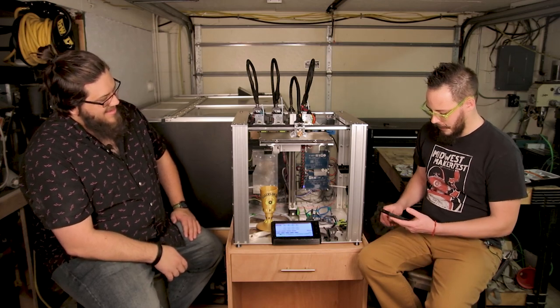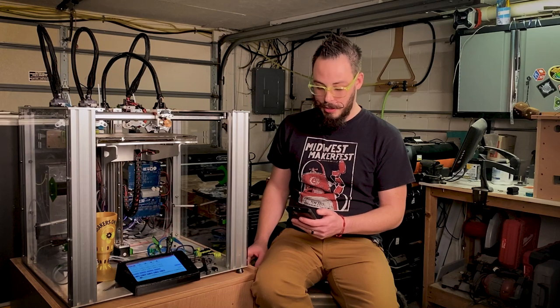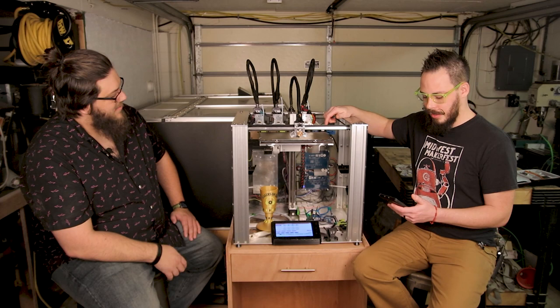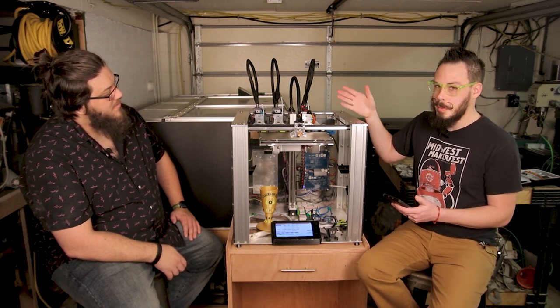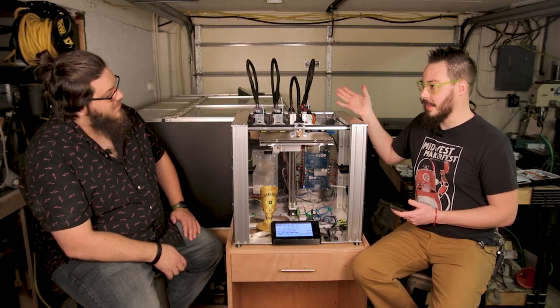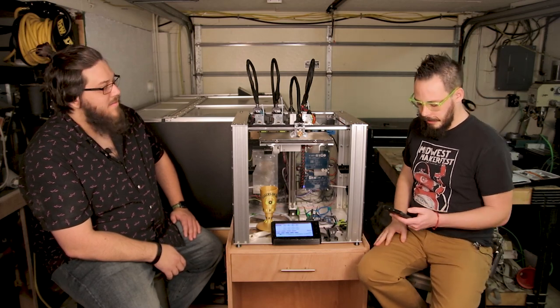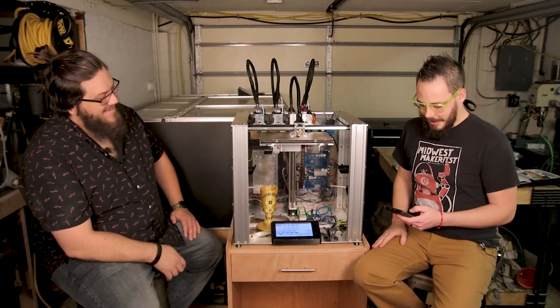I look at my phone because I want to get these numbers right. A couple people asked this. It is an 800 watt bed if you are using the Mordor bed and not the very power bed like I'm using. And a 400 watt PSU is what they ship with the kit. So it should at most be 1200 watts. My machine's using a 500 watt PSU and that's it because I'm running a 24 volt machine. So, you know, a 110 outlet. That's all you need. Fair enough.